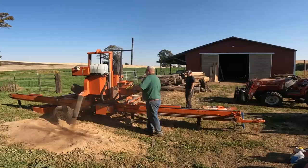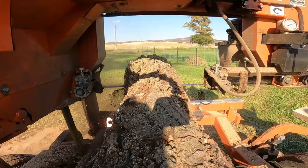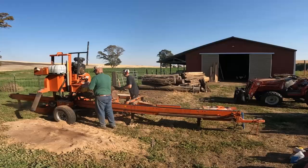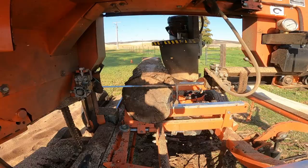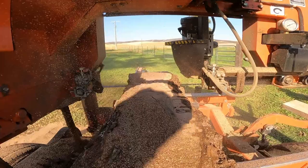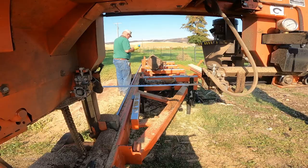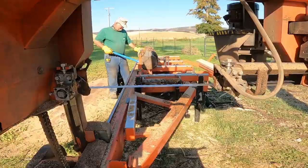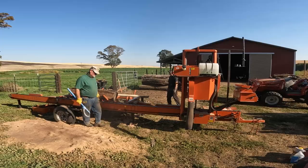And away you go again. This is kind of just the routine for these little guys — you just make sure you get them positioned right, that you can clamp them down right, and you just got to be careful. Take your time, work through them, pay attention to everything going on all the time. If you're new to running a sawmill and you're watching this, one of the things you've really got to do is watch the sawdust coming off the band, watch the band tension — that's the gauge on the right there — watch your debarker, keep your eye out for the customer, keep your eye out for stuff dropping down into the track that can stop the mill. Pay attention to where your mill height is at and what your simple set is set to. The simple set is just the computer on the mill that helps you adjust to the next milling height or the next size. Of course, you're watching your bands.